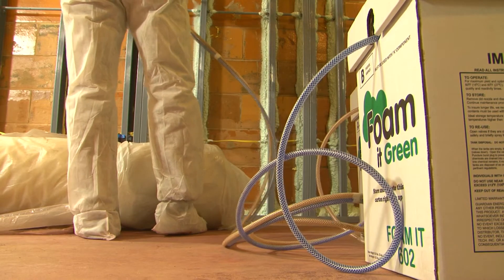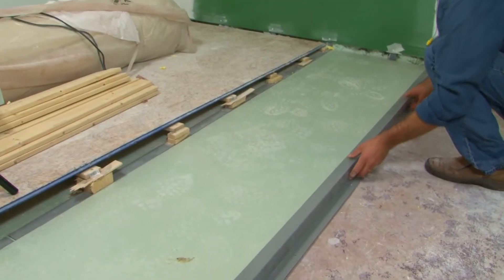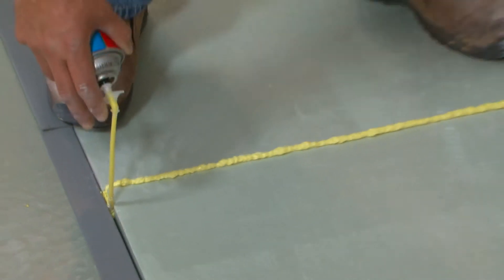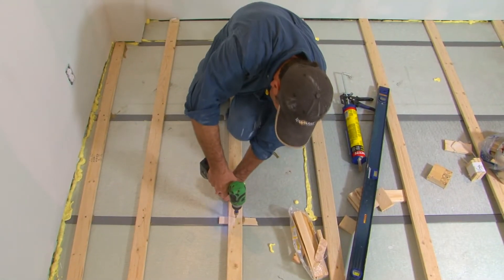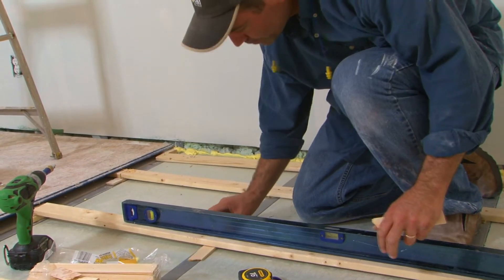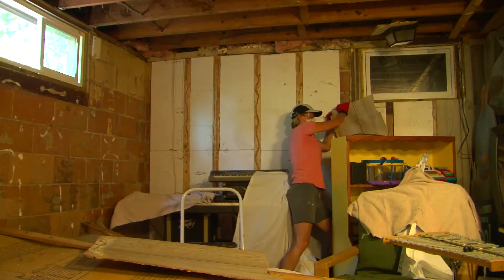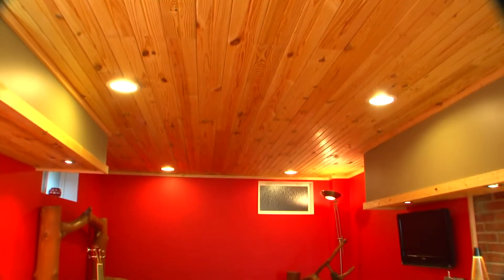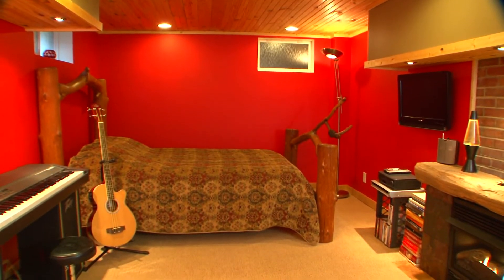That means no mold or mildew either. Next, I installed rigid foam sheathing boards to the concrete floors using EcoStud's Z-Furring strips, carefully sealing each board to the other and to the foamed walls. On top of the rigid foam sheathing, I installed a level false subfloor above the sloped basement floor. Finally, we installed finished materials. In the end, what had been a moldy, musty, dank space became a warm, cozy music studio and guest room, which also keeps heat from escaping from upstairs into the ground outside.